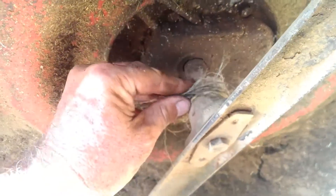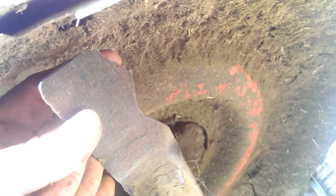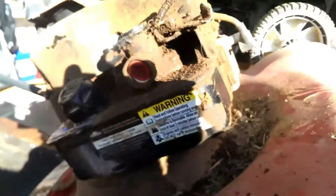Down under here it has quite a bit of hay or hay string, all stuck on it. It's not too bad, but sometimes they work their way up to that seal and end up ruining it, so we're going to clean that off. I'm willing to bet this is the original blade — it was a mulcher, but the wings up here where my finger is are just worn off. The mulching wing kicks up and catches all the sand and debris, and it does double duty mulching grass that has dirt in it, so it just wears them down. Probably going to end up replacing that blade for sure.